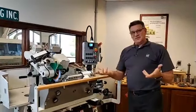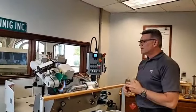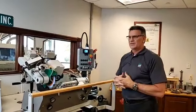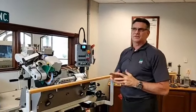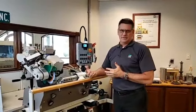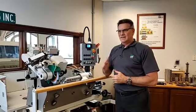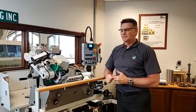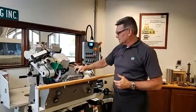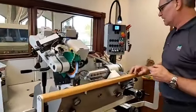Okay, so phase 2 of this discussion is going to be the maintenance of the machine. Too many times we'd get a lot of calls through our diagnostics department talking and working through issues of the grinder itself. And a high percentage of the time, the answer always comes back to cleanliness. And realistically, it starts here with the receiver on the HSK system.